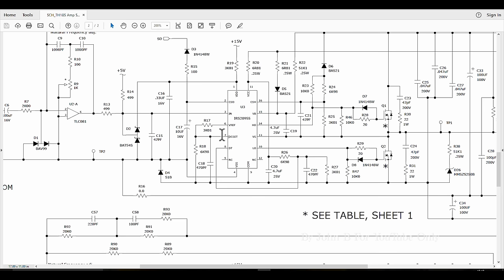If the low side driver FET, if that line, so I can't highlight it, if that line goes over 3.6 volts on this set, to turn this transistor on, this chip will shut down. And similarly, this 6K8 and 3K here, that's for the high side. So if either of the lines exceed the set voltage, the chip will shut down. Obviously, you've got the external shutdown if there's a problem on the wires. So this op amp mixes the signal, comes in here, positive feedback, integrates that, you get the 400 kilohertz out.